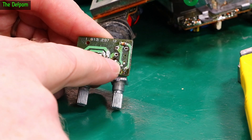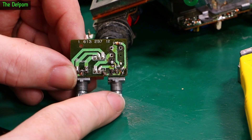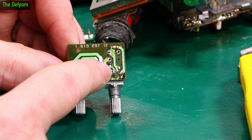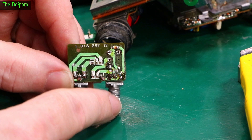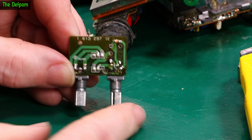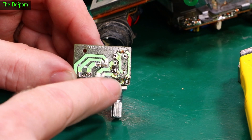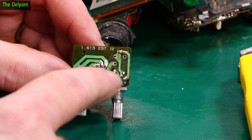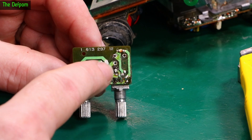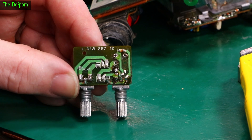I'm going to use this switch to short across this resistor here. Effectively I'm going to put this resistor in series with the pot, so when the pot's in its zero position that's zero ohms one side, 50K the other. If I put this 47K resistor in series with the pot in its last position — which it would be when the switch is open — that puts the pot at about halfway position, like having the squelch set halfway manually. As soon as you turn the pot past the switch-off point it drops to the bottom of the range, giving you full range on the pot manually. So I need to cut the track there, put the switch contacts across that resistor, and link the wiper to the original position.